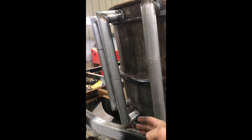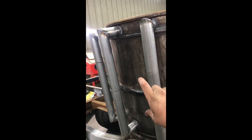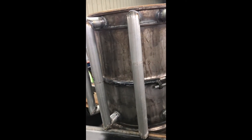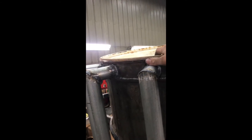I need a whole pile of hose clamps because they'll get cut off top and bottom, and then a piece of radiator hose in between — two hose clamps each. Then the hopper cooling tubes are removable if I ever need to separate the two-piece hopper or if I ever need to clear out the tubes if they get plugged up with tar or anything. Had the barrel clamped down when I did all my welding.